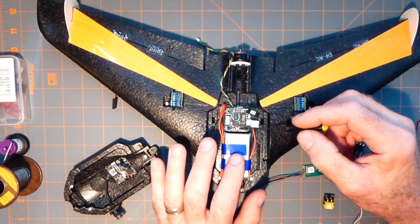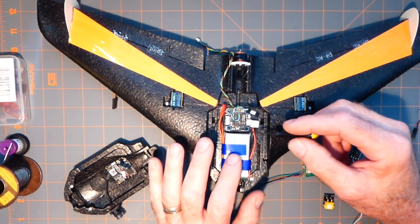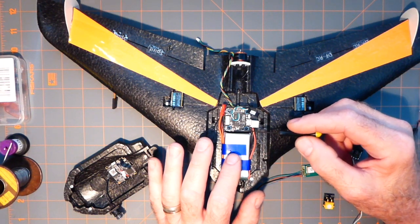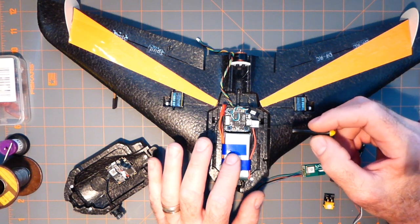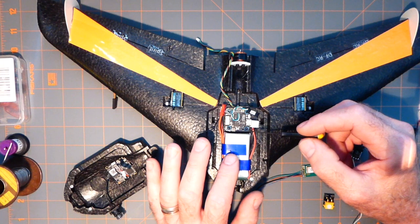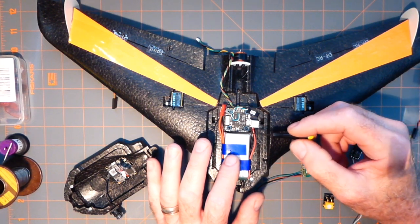The video feed for the flight controllers is here, so I'm going to probably get some regular DuPont connector, you know, the wire part of the DuPont connector, and I'm just going to solder them into these. Which, you know, you have video switch. There's the VTX. There's a ground. There's 5 volt. Then it says camera and VBAT ground. Okay. So we have all that lined up there.